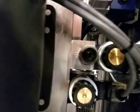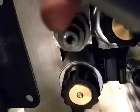That point is first limited by what's under this cap, which is your main pressure control valve. So turning, it's hard to see because my phone won't focus on it. Turning this screw right here will increase or decrease the entire system pressure.